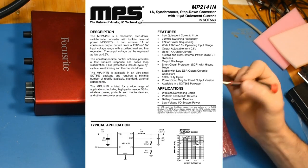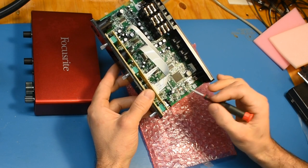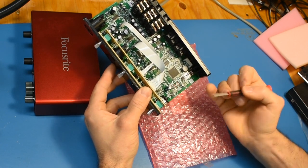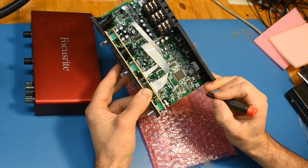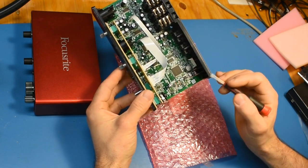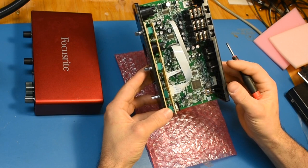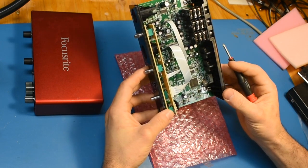This regulator is just an off-the-shelf part. I'm not sure why it keeps dying — it appears to be operating within specs. It has a soft start so I don't think it's inrush current killing it. It's very hard to measure temperatures here since it's a tiny package, so I'm really not sure. I've been tempted to add a high-voltage crowbar to avoid further problems, but it was kind of tricky to fit in here and I just never got around to doing it.